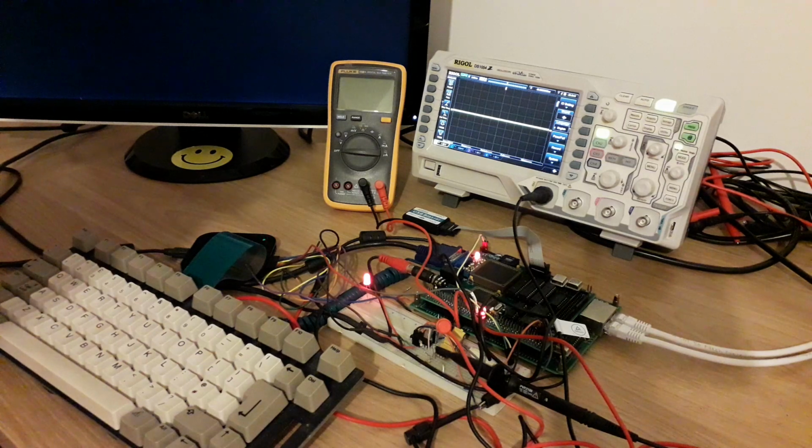The topmost board is probably more interesting. The main feature, the big square part in the middle, is an FPGA. It is an Altera EPF10K10, which is part of the Flex 10K series, which was a current product probably from around 1992 to 98 or something like that. It's interesting because it's 5 volt compatible. Well, they did do 3.3 volt parts as well, but there's a whole set of 5 volt compatible parts.